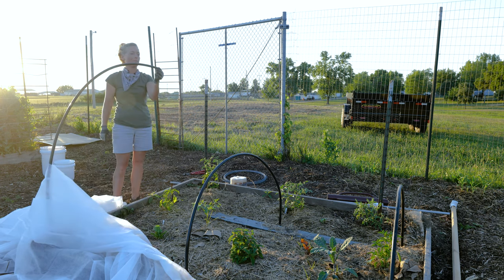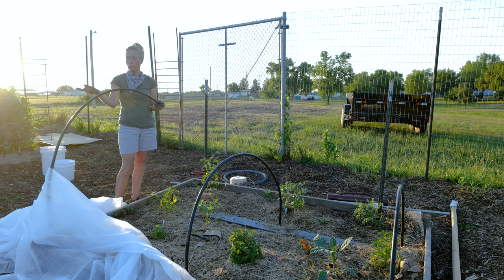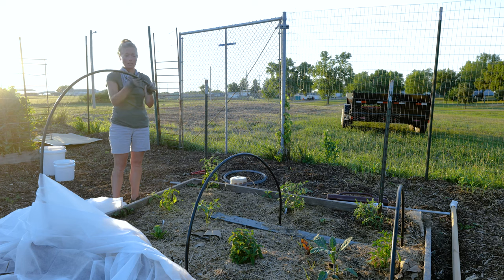And this is irrigation line that you would buy, it's not for heat, you know, it's an in-ground line, the cheaper version, not like a PEX, it's not for hot water, it's for regular cool water, translocating water from one source to another in the ground. And so this will handle, I think, 100 PSI, and you can get it in a 100-foot roll from those big box stores. This is a 3/4 inch piece of hose. And so it's in a roll, and I just cut it to length.